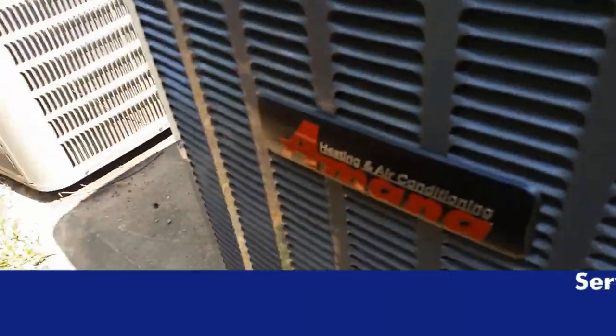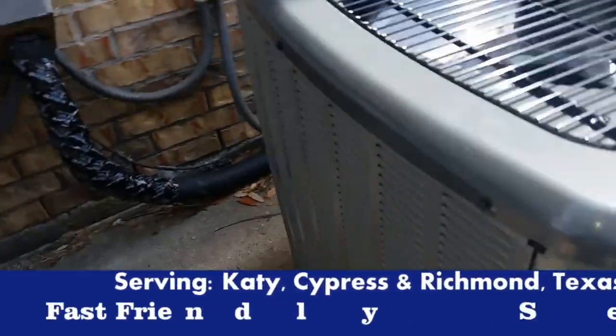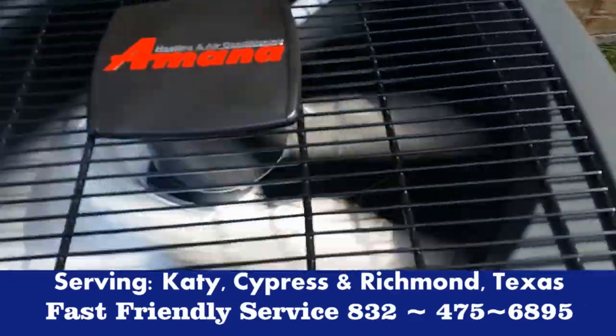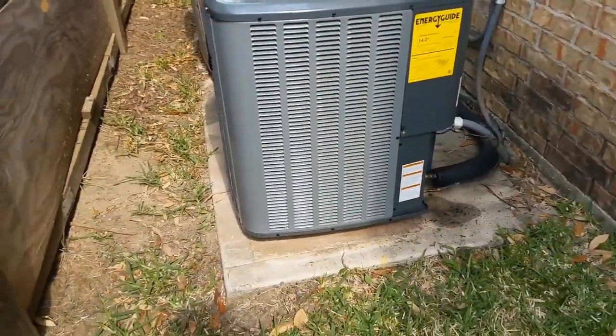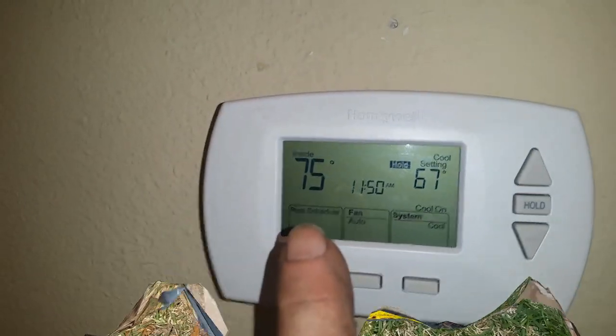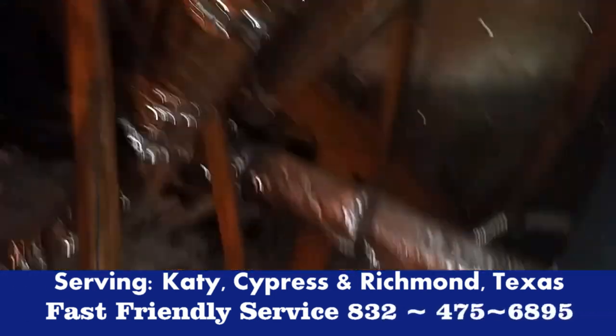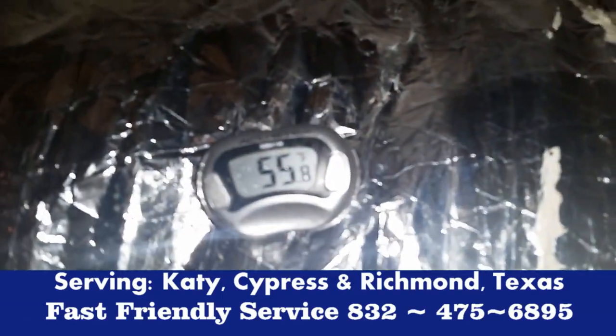There have been problems with Freon leaks at this house, and I'm going to touch base on that coming up in the video. Here I'm showing the temperature drop across the coil. This is fairly typical — I almost always see this because I do the work myself. In my location, temperature drop parameters are between 15 and 20 degrees, so hitting that 20-degree differential is always what I want to shoot for. We had a 75-degree indoor set point and the thermometer in the supply reads right at 55 degrees, giving us a 20-degree drop — a sign that everything is working well.